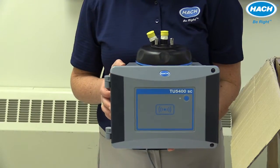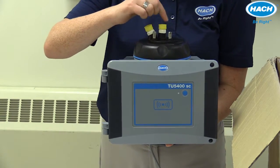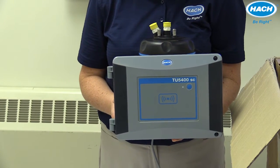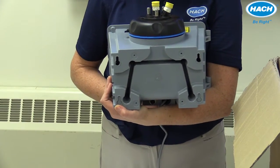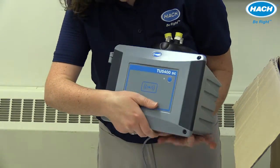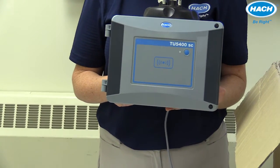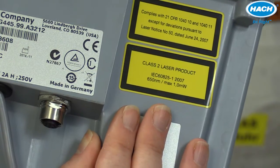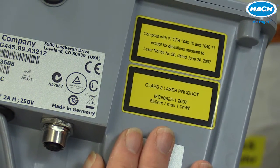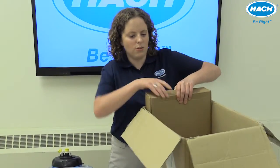In this case we have a TU5400SC. You'll see the inlet and outlet ports for the instrument tubing, as well as screws that provide easy access to clean the vial without needing to disassemble the instrument. On the back of the turb, you'll see four different channels that allow easy routing for accessories that may be attached later. The front of this instrument has a picture showing that this particular turb is equipped with RFID for calibration and easy comparison between the online and laboratory versions of the TU5s. Before continuing, verify that the part number and serial number on the back of the instrument match the label on the outside of the box.